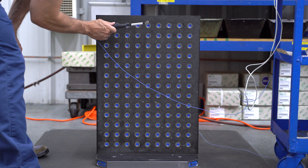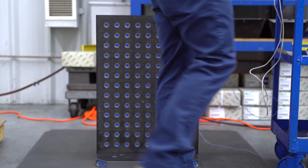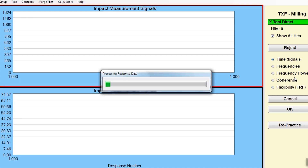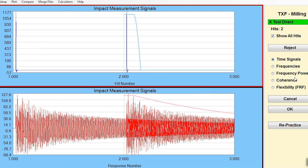For each tombstone we did two separate tests. The first is to measure a frequency response function — the output vibration over the input force in the frequency domain — so we can see all the natural frequencies of the structure and the damping ratio associated with each one. The second test looked at the free vibration response: we tapped it with a hammer and looked at the decay rate of the accelerometer signal for each of the four materials.